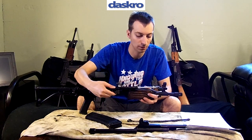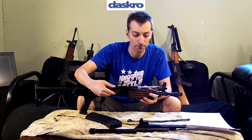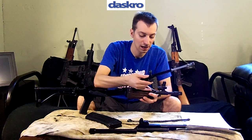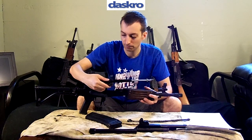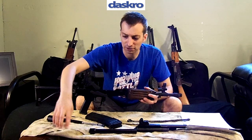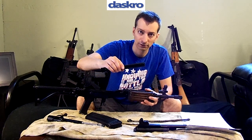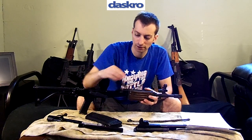And we know that it's going to take the path of least resistance, which is the bolt carrier, because it's not fixed. Everything else here is fixed. And then it pulls back. And then once it pulls back, the gas gets exhausted from these little holes. You can see these little holes on this gas tube right here. And that's how it operates.